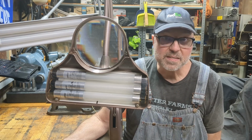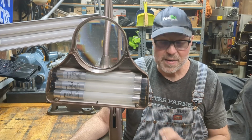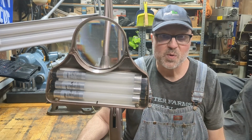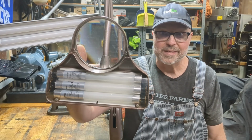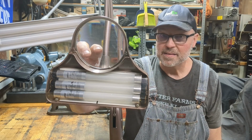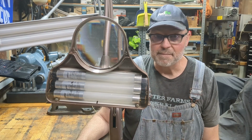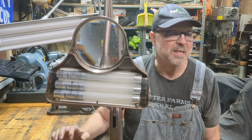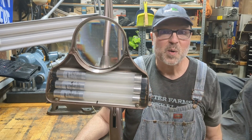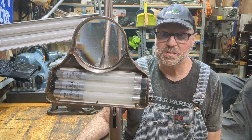And what that means is that with ballast bypass, you take the ballasts out of the lamp. You don't use them anymore, and you just wire these up basically like a regular light bulb. You have a hot lead going in, and the neutral coming back out through a switch, and that's about it. It is pretty straightforward. The wiring on LED ballast bypass is much simpler than what we see in a regular fluorescent light.